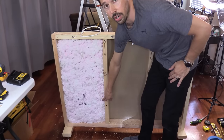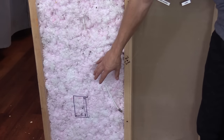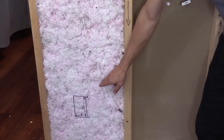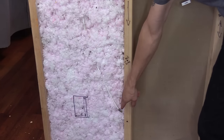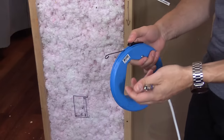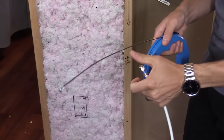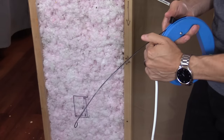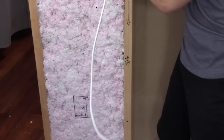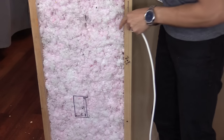The cable is over here — this is loose insulation. If you have packed insulation, it will probably curl up and get stuck. Since this is loose insulation it managed its way down, but still curved. We need it right about where the wall plate is. You could use a fish rod or fish tape, but if you're in the attic, fish rods are hard and clunky to maneuver, and fish tape bends — so even if you fish the wire down the wall, it can turn as well.